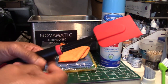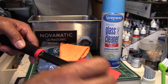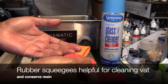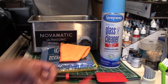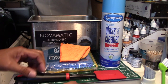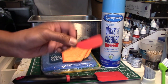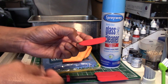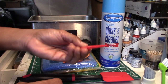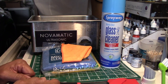These rubber squeegees can be made from a cheap spatula you find at the Dollar Tree. They're useful especially when cleaning your vat and trying to conserve material — you can squeegee the vat so the unused resin drips into a cup and you can pour it back into your container. 3D Print Farm is a YouTube channel that lists a link where you can buy pre-cut rubber squeegees, but they last a long time especially if you clean them off.